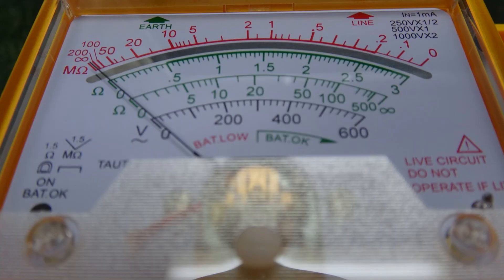The test leads and fuse's zeroing knob is the 0 ohm-adjust knob. You can zero the resistance of the test leads and fuse by shorting the tips together and turning the 0 ohm-adjust knob until the needle shows zero on the meter.